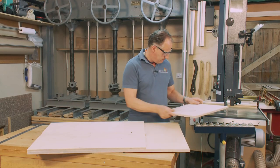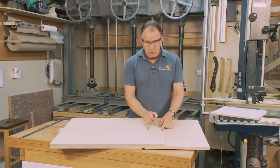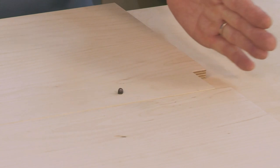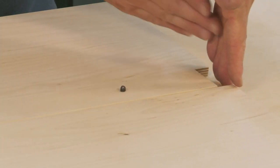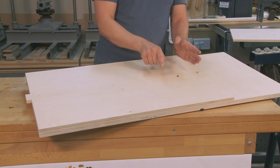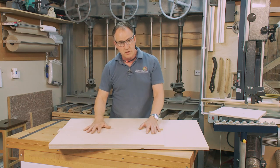What I've got here is a jig that basically has a sliding centre. This screw is going to pop into the centre of my plywood later on to be the centre of my circle, and I've got this so it's really quite adjustable. The bandsaw blade is going to be sitting through here - I could cut maybe just a two inch radius, or if I turn this piece of plywood around and push it out I could be cutting up to a four or five foot radius, so I've got all the sizes in between within this one jig.